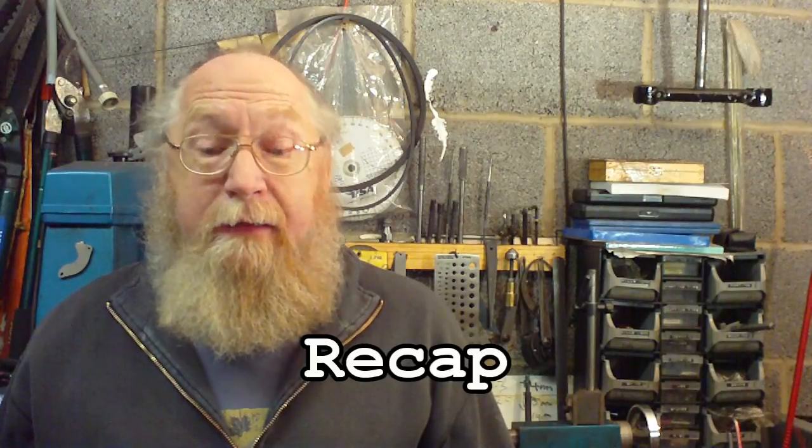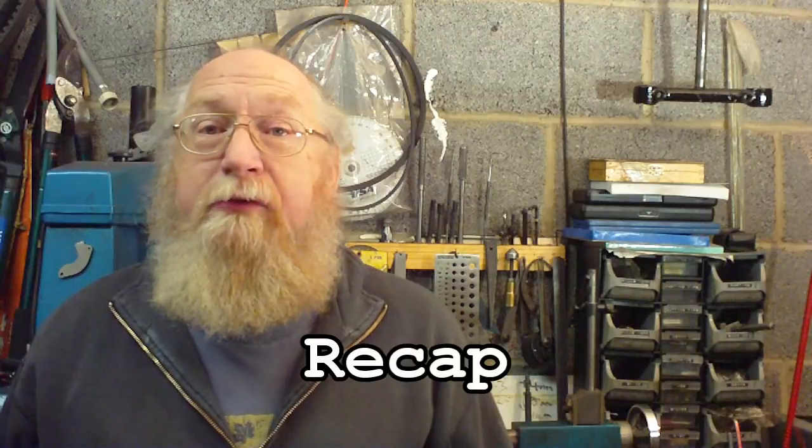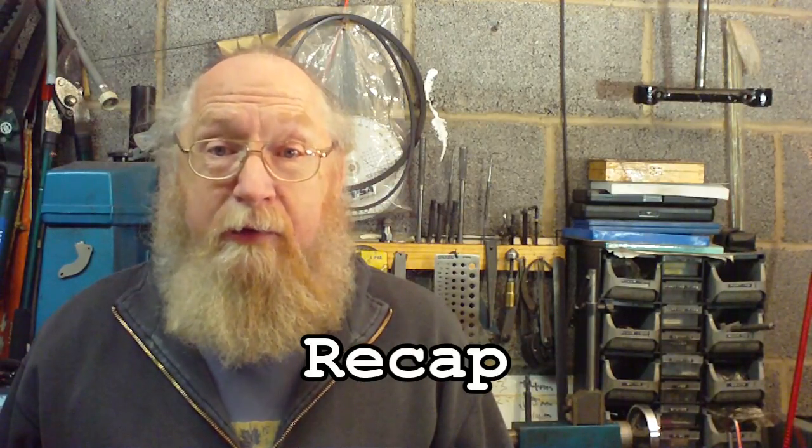Never leave the key in the chuck. That is a no-no. If there's a manual with the machine and you're new to the machine, always read the manual. Familiarise yourself with the controls. Minimise mistakes. Never leave a lathe running unattended. Do not wear any dangly clothing, earphones, hoods or gloves, and long hair must be tied back out of the way.